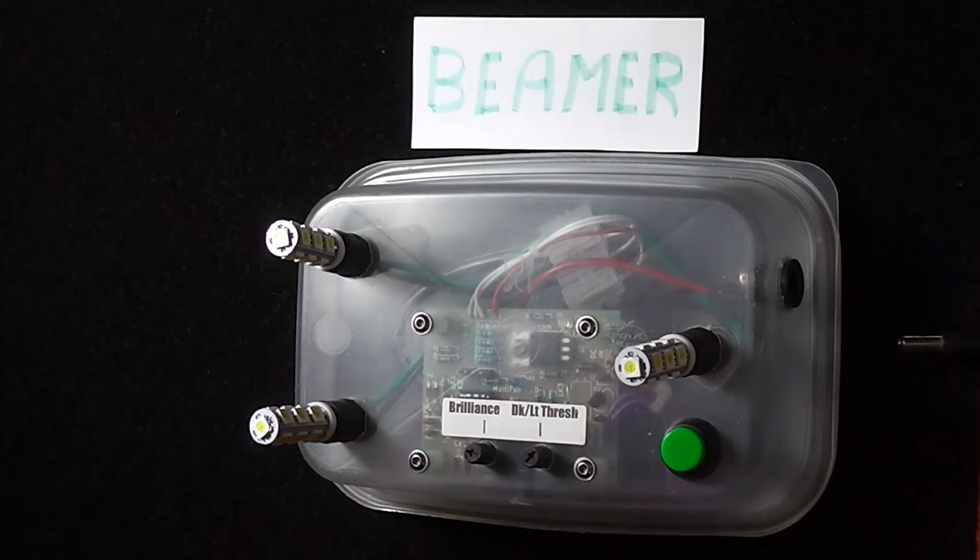But the problem is, by firing up the lights on itself, the LDR sensor now picks up the light that itself is producing, which causes oscillatory feedback, and this can be quite bad. I've tested a couple of them, and I've found them all to oscillate at certain low frequencies under certain circumstances. So I tried to think of a system which would get around that problem, and the one I came up with was to switch off the Nightlight completely for a fraction of a second, and during the off time, which is hardly perceptible to the human eye, to make a sample of the light level. So in a sense it gets a true ambient light level value.